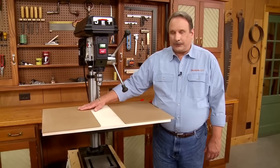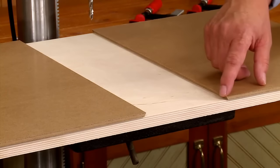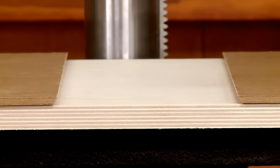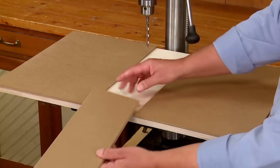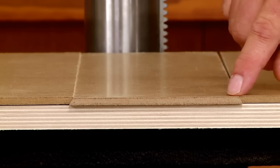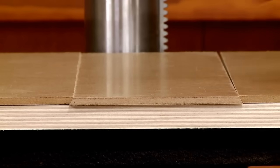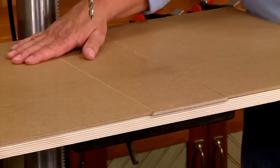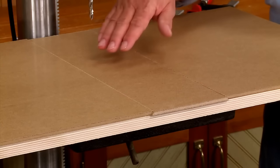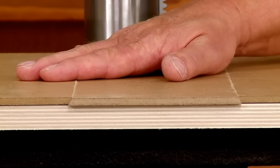How do you glue the two pieces down and have a removable insert that stays in place? The inside edges of both outside pieces are beveled. The insert is then beveled the reverse way, and the bevels hold the piece down, effectively creating a sliding dovetail joint. The inside piece slides into place; the bevels hold it flat and smooth, creating a nice smooth surface for your workpiece.